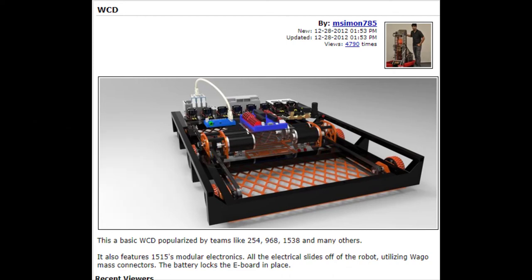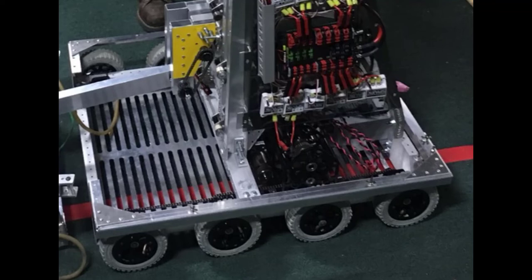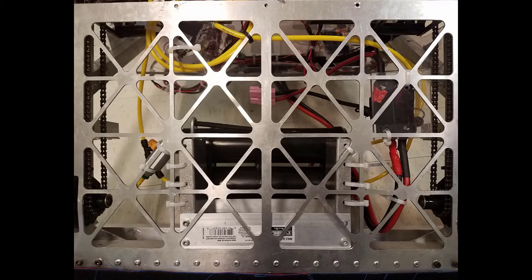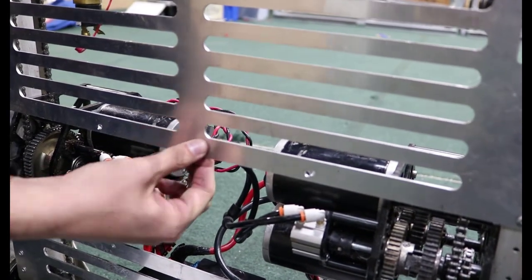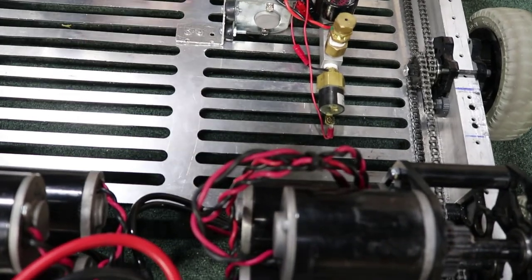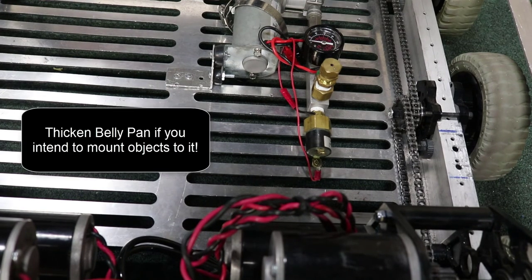The last thing about the belly pan I want to discuss is pocketing. You can make some beautiful designs or some simple designs — you could even spend some time cutting shapes for every electrical component on your belly pan, and this part is completely optional. A simple method for us is the slots method, but we've used the fancy pockets with our rookie team. Whatever you do, make sure you radius every sharp corner because certain machines, especially CNCs, will dwell in a sharp corner and leave burn marks or blow the material out. This will also help the negatives drop out easier and your sponsor will prefer that. If you have a thin belly pan, don't go crazy on pockets because it will flex. Be wary of long pockets too — you want support down the middle and sides where the pan attaches. If you're mounting electronics on the pan, go thin on the pocketing and thicker on the material to protect these parts from shock loading.